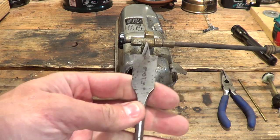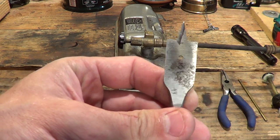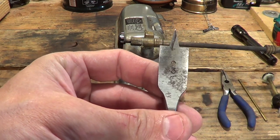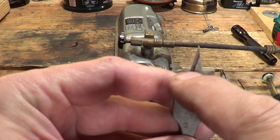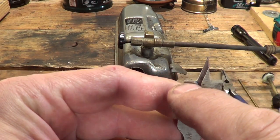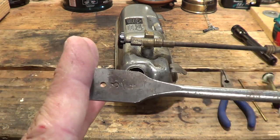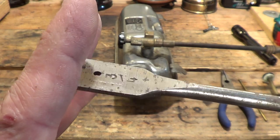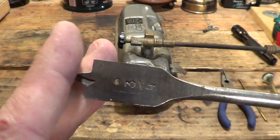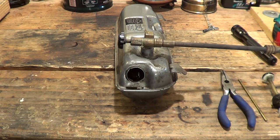What I've done is found a spade bit — this is a three-quarter inch, but I've found a half-inch one works. I take my grinder and grind it straight down flat, so it's kind of like this, and I chuck it into my drill. It's a half-inch paddle bit or spade bit with a flat end on it, and that's what I use to remove my check valves.